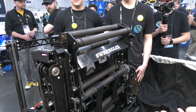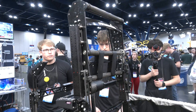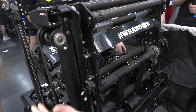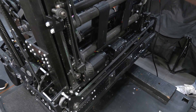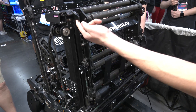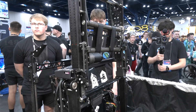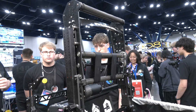For the amp and trap mechanism we wanted great packaging, so we have a one-and-a-half-stage elevator. The first stage is our static stage, and the second stage runs on belts from a single motor across to the timing belt. When the first stage raises it lifts the belt, which hits the polycarb, which then rotates and raises our half stage. Caleb, raise the amp — as you can see it drives this motor, getting us that 47–48 inch maximum height for the most efficient trap possible.